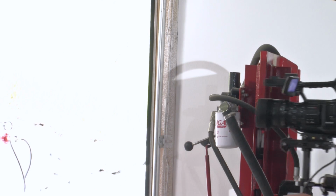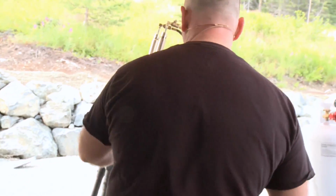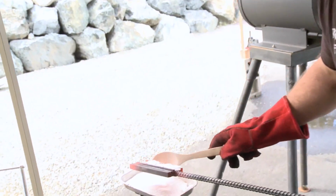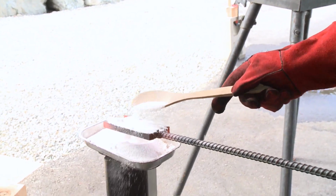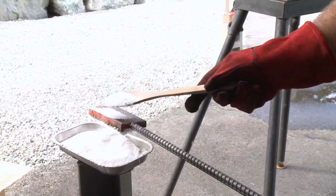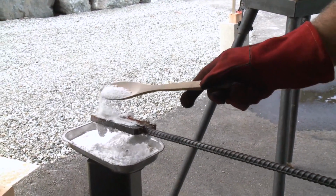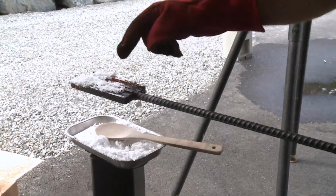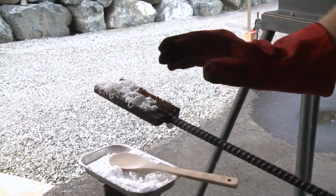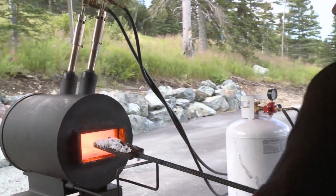I'm going to stick this on the welding table. And now, I just got that too hot. Look at that. So I am of the flux early, often, and repeat school. Lots of people aren't of that school. Your mileage may vary. But when I do multi-bars, I just coat the crap out of it with flux. You see how that bit on the end got a little too hot and it started to flex over? So that's a gap and I don't like that. So I'm probably going to pinch that just a little while it's dull red to get it back into close proximity.